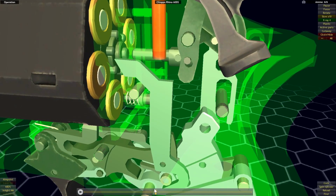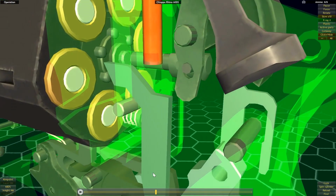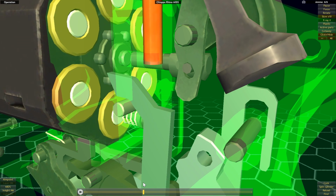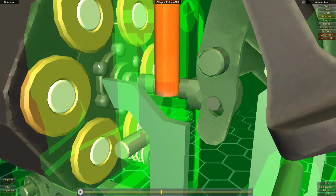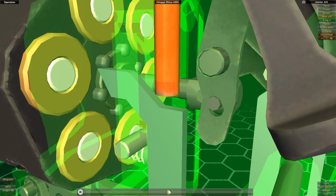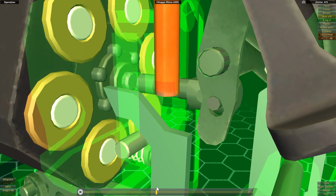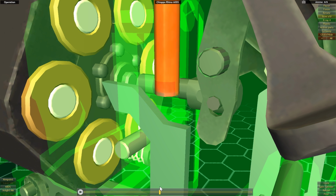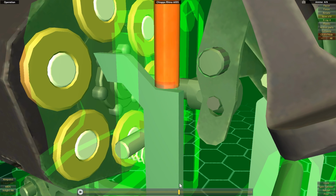Now, as we've seen with a couple other examples, the timing of this animation is pretty poor, as we see the hand is not really even barely making any contact with the peg before the cylinder starts revolving. The hand would actually come up and contact the peg, roll along the rounded outer surface of the peg, rotating the cylinder along. The timing of this is very poor. More or less, the cylinder would not be rotating now. It would start rotating once the hand got to about there, and then we would have that rotation. So just poor timing here.